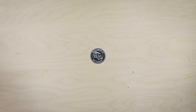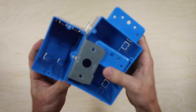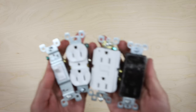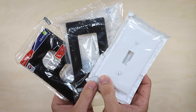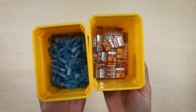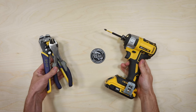Here's a list of parts that you're going to need for this project: 12 gauge 3 conductor wire, electrical boxes, switches, outlets and GFCI outlets, face plates for the GFCI outlets, switches and outlets, lever nuts and spade connectors, and some various tools that we've already talked about in a previous video.